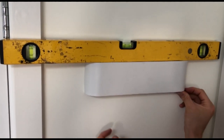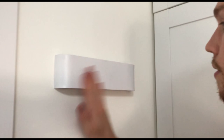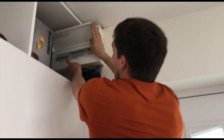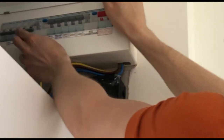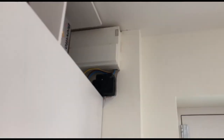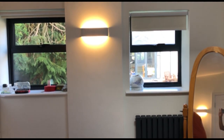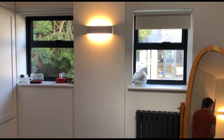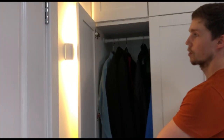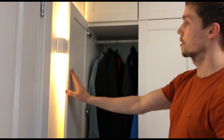Now is the moment of truth. Go back to the consumer unit, turn on the RCD, turn those switches back on, and go back to the light. There we go - we've got both of them on the wall. You can see the nice inline light - it fits into awkward spaces and I can still open the wardrobe fully. It doesn't get hot because it's not a high wattage lamp, so you could leave it on all day.